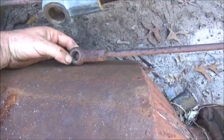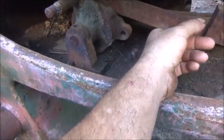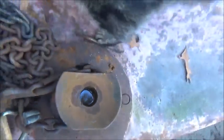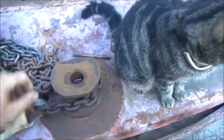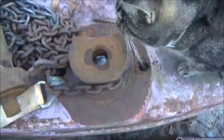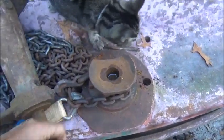It's got a brass end — it's not even stuck — reverse thread — and then it's got a steel end with a bushing inside of it. Both of them go on here and this is the safety gear. The rod runs up from here and then runs through this hole, up to our governor, and our governor weight hangs on the other side. This is just a bolt shoved down in the hole — somebody had just stuck a bolt down in there. So we've got two holes, probably two bolts. The flange is 10 inches — I've seen that on the prints.